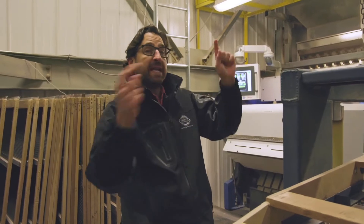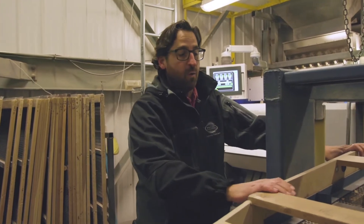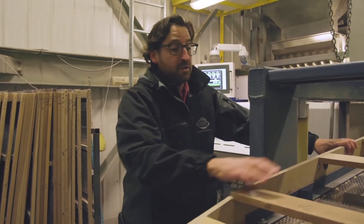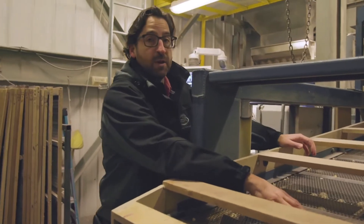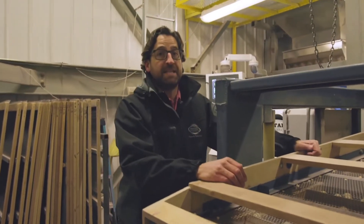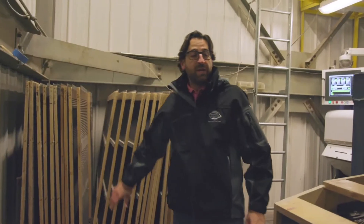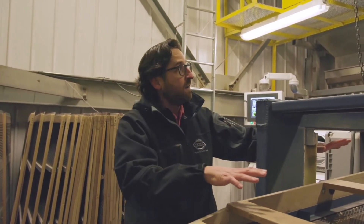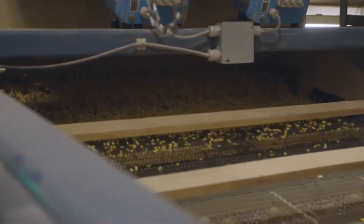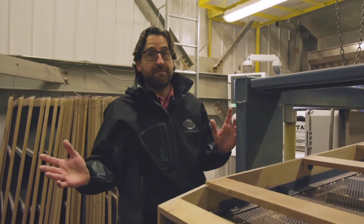When we bring corn from the bin into the tower, we put it into these overhead bins getting ready to feed this scalper. What we do with this scalper is we set the top screen and the bottom screen. The top screen has a 25/64th of an inch hole. The bottom screen has a 15/64th of an inch hole. We flood this scalper with corn — any corn that doesn't fit through the top hole falls off the screen and is discarded. It's too big to bag for seed.